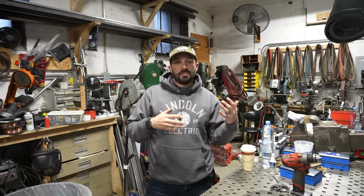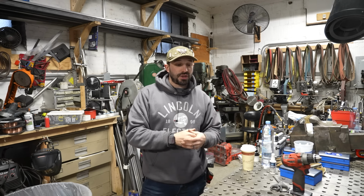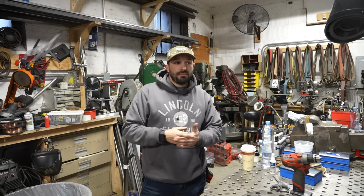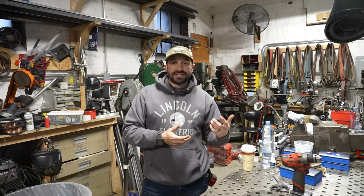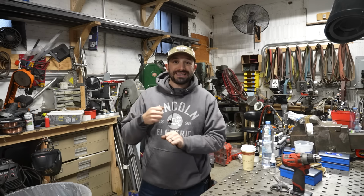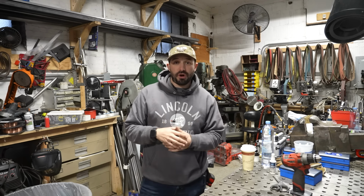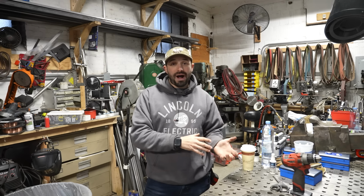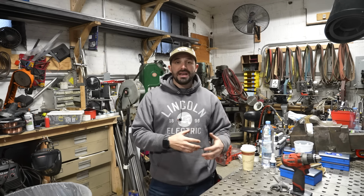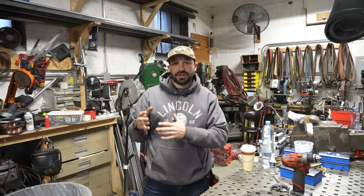So one of the sort of mysteries that I tried to debunk with my last video on this topic was that you don't need really special drill bits to drill holes in steel. Most big box store drill bits will drill holes in metal. Unless you're using like a brad point bit that's specifically made for wood, your twist drills will work. That being said, a high quality drill bit is going to absolutely make a difference in terms of longevity, the amount of effort you have to put into drilling a hole, and how long it's actually going to last.